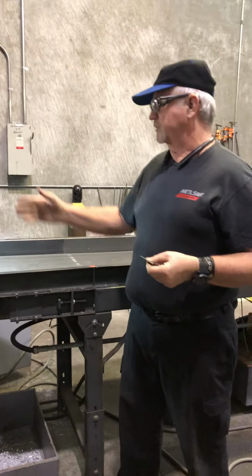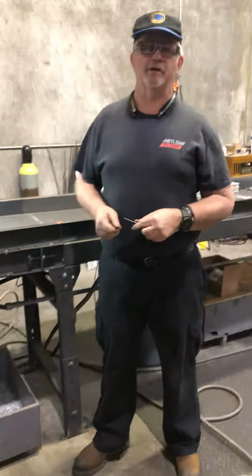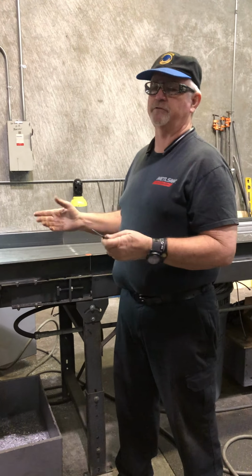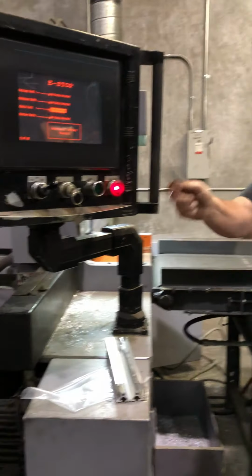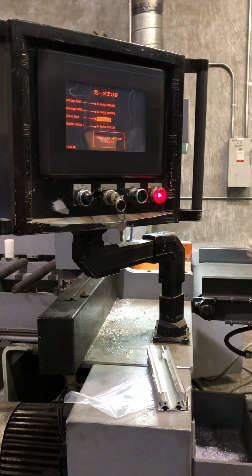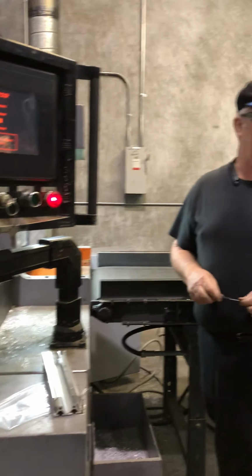Suspend after cut means I'm going to finish my cut, then I'm going to go back to a neutral position. I'm going to wait for you to tell me what you want to do. All right. So immediate suspend is if there's more danger. And then, of course, you have the E-stop that stops everything. Don't be afraid to use the E-stop. You guys aren't cutting anything so heavy or so bad that if it stops everything right now, you're not going to hurt anything.